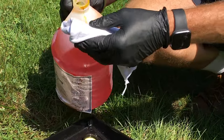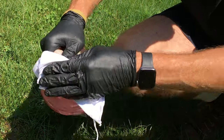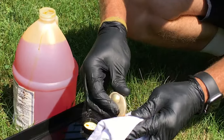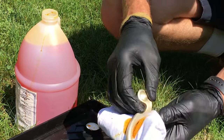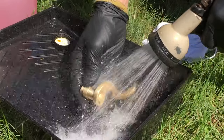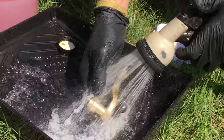Be sure to use fresh clean gloves to protect your hands and to keep your finger oils from contaminating the clean brass. Clean the brass thoroughly with the Jaxx metal degreaser and then rinse thoroughly with water. For the best results, wash the parts again in water with a little Dawn dishwashing liquid in it. Rinse thoroughly and allow to dry.